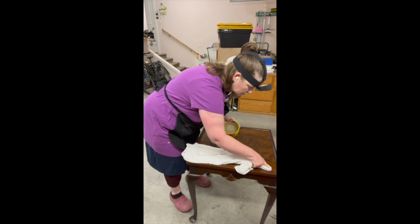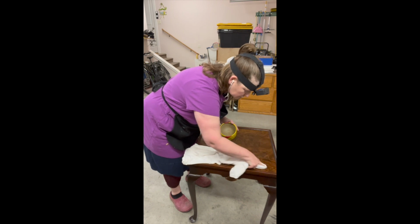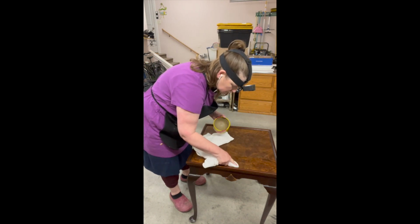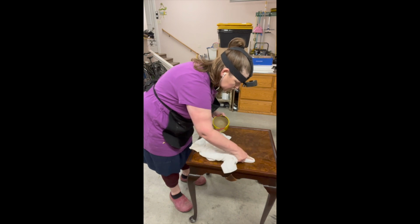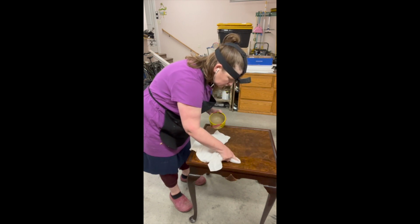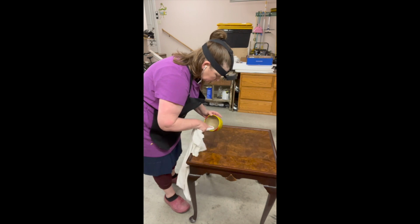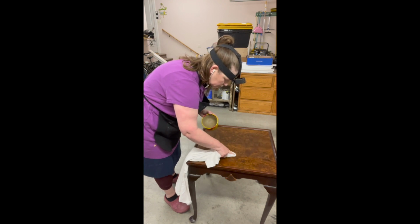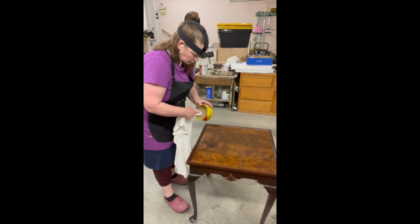And it says, once again, to put the wax on with the grain. Burled wood, grain goes crazy. So where there was some grain that went a certain way, I kind of went with that. But then I'm thinking to myself, it's a lacquered piece. Does it really matter if it goes with the grain or not? So I don't think it really matters. But I did use 2 coats of this. And it says that you can polish it once it becomes a kind of cloudy gray color. So I did that 2 times. And then it just didn't get shiny. So I went with my favorite Howard Feed-N-Wax, and I did the 3rd coat of that. So once again, Howard Feed-N-Wax can go over almost everything, but not anything can go over it.